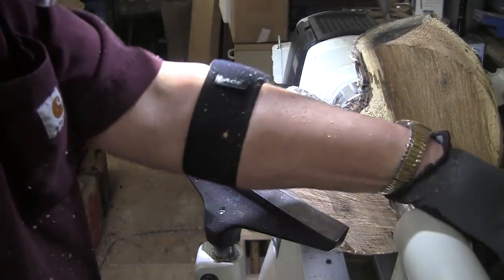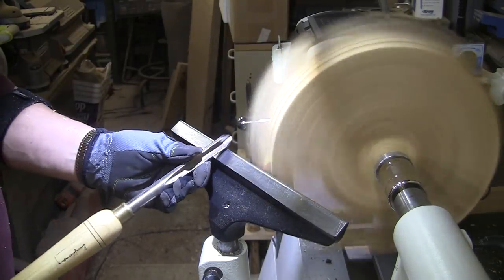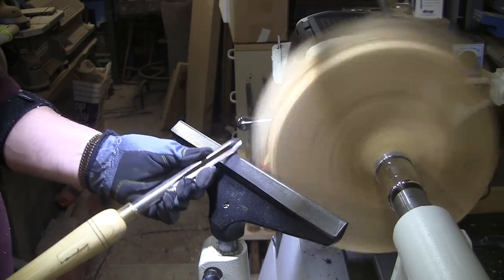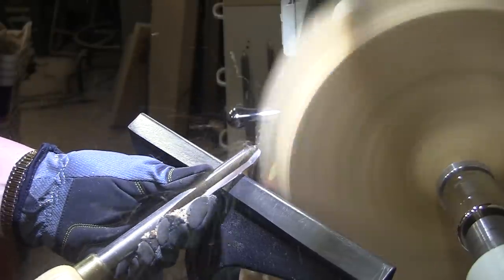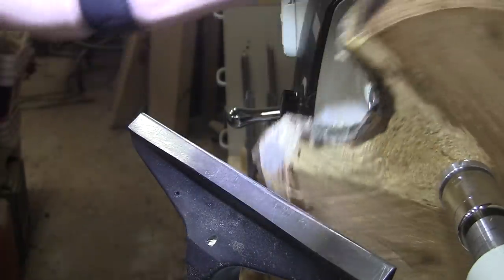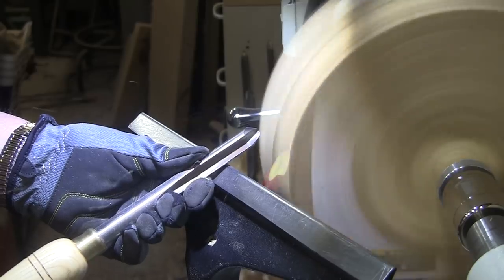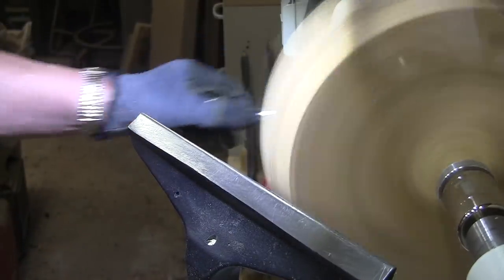Well, my 3 screws are not holding. We'll see if that's going to work or not. The nose here is sinking in pretty good. The screws can't come out, they can only get loose. They're trapped against the jaws of the chuck. I'm gonna see if I can pick the speed up any. About 480.